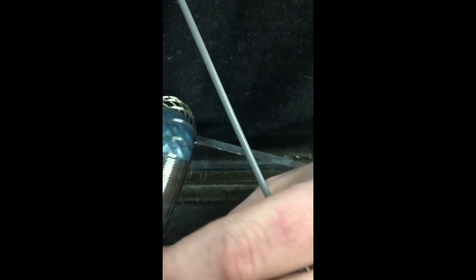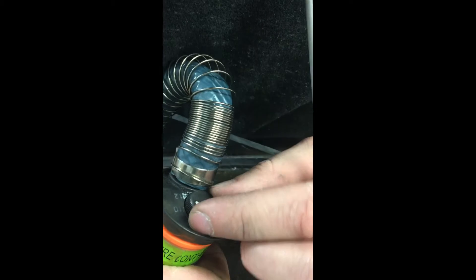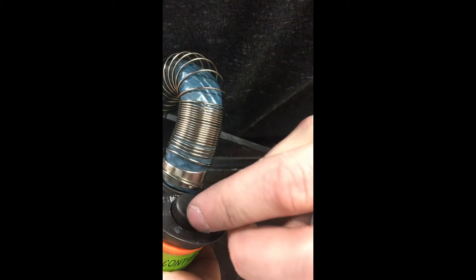Now we're going to do a little bit with PVC. PVC doesn't really melt that well — it's more like a hot-glue style of welding. This is the Harbor Freight PVC filler rod, and this is the one that'll kind of brown and char if you start heating it too hot. See there, we're starting to char a little bit using the same temperature as polycarbonate. If we turn the Harbor Freight welder down to about eight, that's about the right temperature for welding PVC.